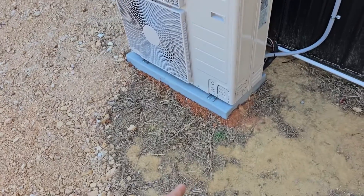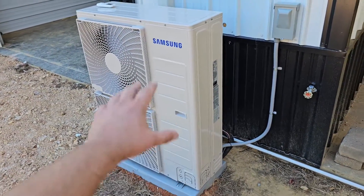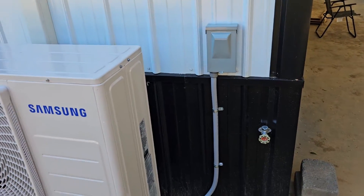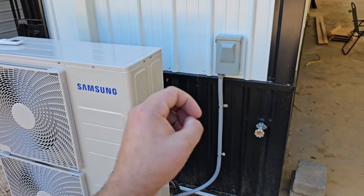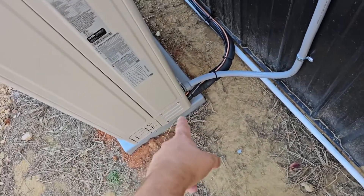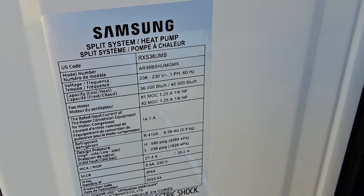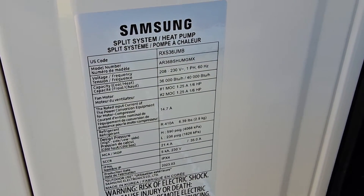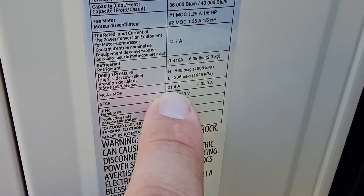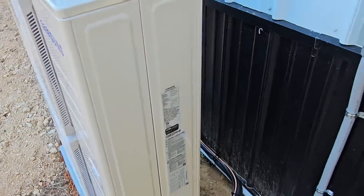The outdoor unit is sitting on a pad that's 18 inches by 36 inches. This is a super nice unit — look at that, it looks beautiful. Look at the disconnect: it is away from the outdoor unit so the inspector will not fail the final inspection. You want to make sure you don't cover the disconnect and can open it without touching the outdoor unit. You can see where the conduit enters the outdoor unit and the line sets. This says 36,000 BTUs, the minimum circuit amps is 21, and a 35-amp double-pole breaker runs the whole unit — it pulls about 20 amps. That is excellent.